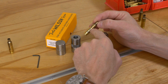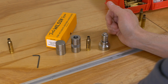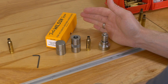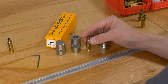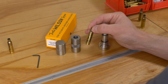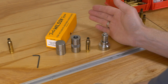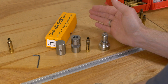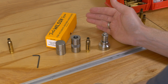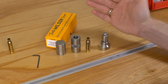I recorded one thousandth of an inch last time — I might have been comparing against a different unfired piece of brass. Everything's going to vary, so you're going to want to take multiple measurements of unfired brass and size multiple times. Make sure you've sorted your brass by headstamp — I'm using Hornady brass here. Different brass has different thicknesses, springs back differently, and has different hardness. You definitely want to sort by gun fired in and by headstamp. If you follow these instructions and have the right tools, you will do great.